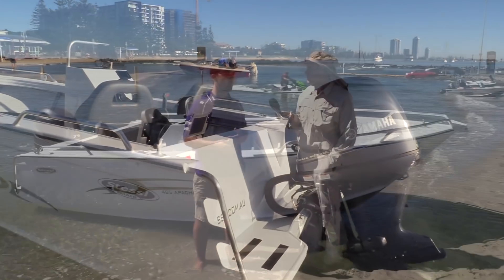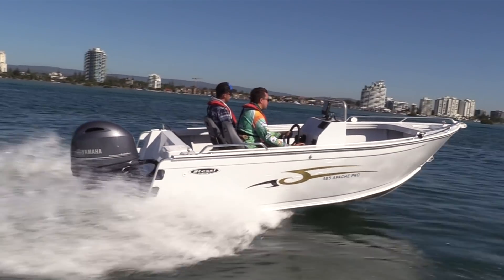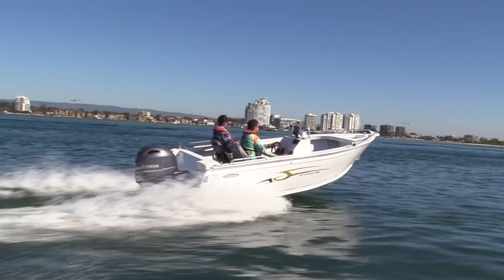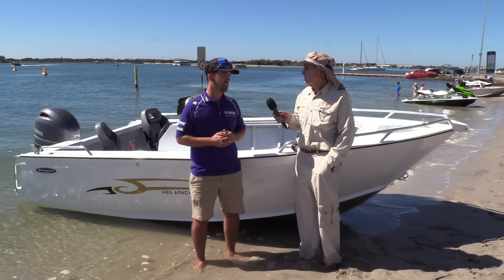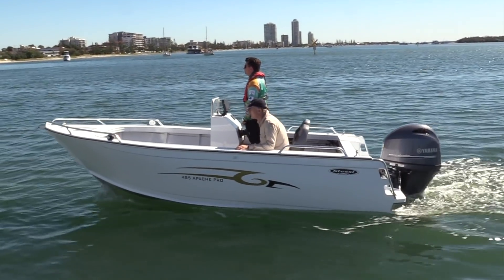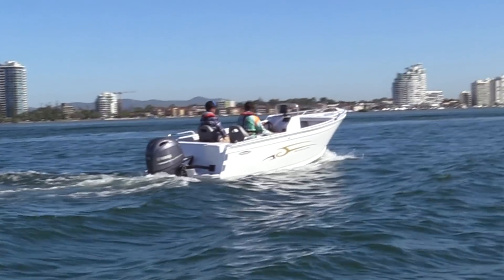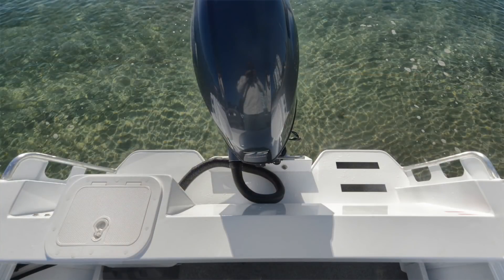Some people have asked why an engine only five horsepower more. Well, you look at what the Australian boat manufacturers plate their boats, and what you'll find in the marketplace is a lot of boats are actually rated to 75. Market trends tell us that the punters want maximum horsepower to go as fast as they can on the water, so this fills a very good gap when you take Australian builder's plates into consideration. Under the cowl of this 75 it's a 1.8-litre inline four-cylinder engine, four valves per cylinder with a single overhead cam. It's got all the standard Yamaha four-stroke features including the YDC-30 alloy, which means ten years down the track you're not faced with nasty corrosion through your engine — it's an engine that's going to last and last.